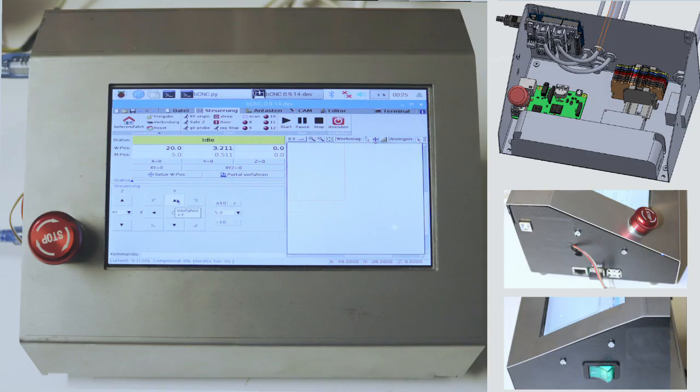Let's take a closer look at the computer unit. The computer has a solid metal housing and is reasonably dustproof, making it perfect for a dirty and rough environment like the garage or workshop. On the front you can see the 7-inch LCD display with the CNC program running. You can use the manual mode and move the motors with mouse clicks. You can enter g-code commands in the command line and load your program and let it work in automatic mode. Also on the front side is the emergency stop button. It stops all motors and also the MF70 spindle. This is a very nice and useful feature.